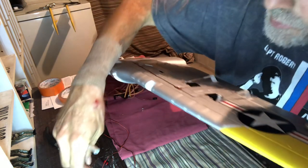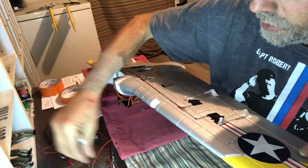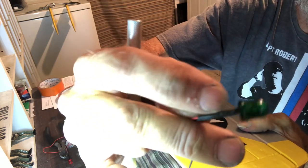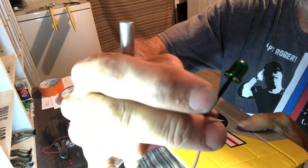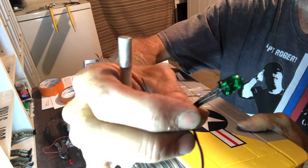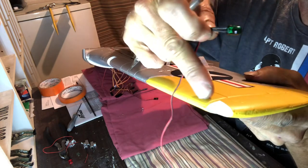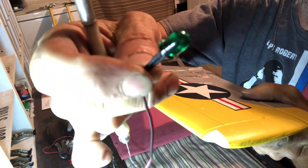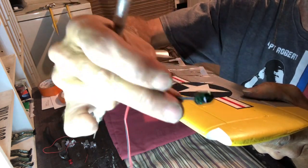But what you got to do is, you got to remember, shorter. Them LEDs has got this plastic covering over it right here. You know, it's the shrink wrap they put over it. Well, that LED's also got a resistor in it right there, right dead in the center. And you got to be very careful with these things. You start pushing and shoving and ramming, you're going to break them leads and they won't work. So you got to be careful. So when you make this cut right here at the first, you want to make it wide enough to where that lead that's covered up there will slide down in it with no problem. You don't want to be pushing on that.